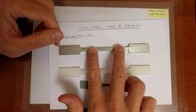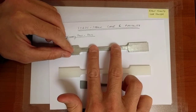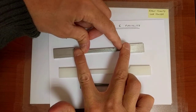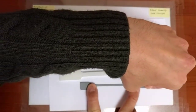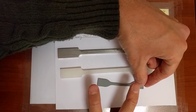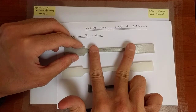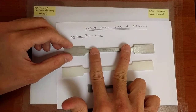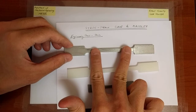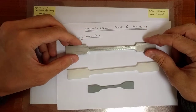And plus, when you hold the specimen in this monitored portion, which we're going to call the gauge portion, there will be grips, and these grips will hold the specimen rather tightly, and then when the specimen elongates, the grips will elongate with the specimen, so that this amount of elongation will be able to deliver us information about the strain. So we're going to have something called an extensometer that will look like two fingers. You'll see this in the lab experiment, and when the two fingers move away from each other, we will be able to measure the amount of strain, and from the load cell, the load information will be extracted, which will help us measure what the stress is.